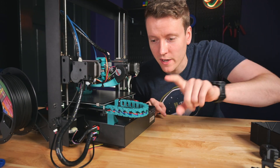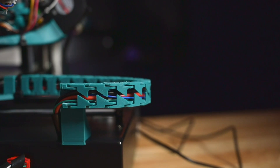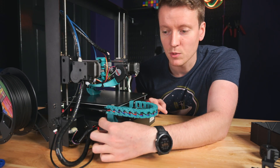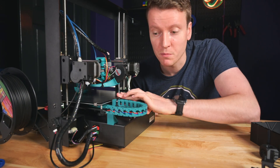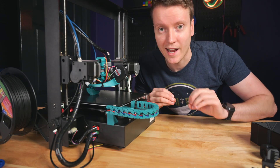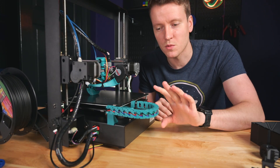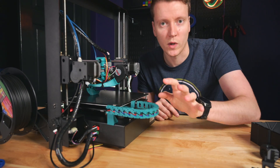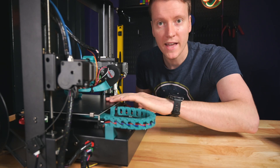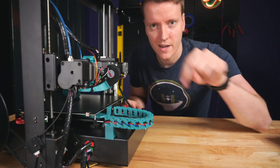Going around to the back of the printer — this was an upgrade I put off for way too long. This is your Y carriage cable chain. When the bed moves forward and back, this cable chain keeps the cable well managed. This is a safety risk, and I would highly recommend you print this way sooner than I did. In stock mode the printer just has the cable coming out of a metal hole in the chassis, and every time the bed moves it rubs the PVC sheathing against that metal hole. After a while that sheathing wears out, which is a huge safety risk — those wires are high power and if they arc you could easily start a fire. Print this one out fairly early on. The other cable chains on the printer can be replaced if you want, but this is the only one I'd call essential as a safety feature. I'll link the specific model I used along with all the other models down in the description below.